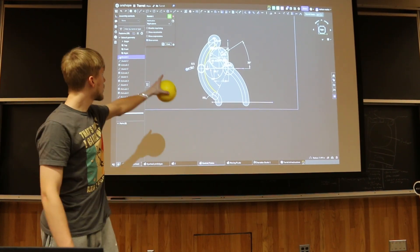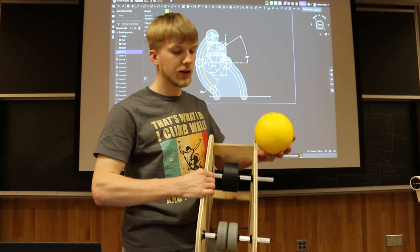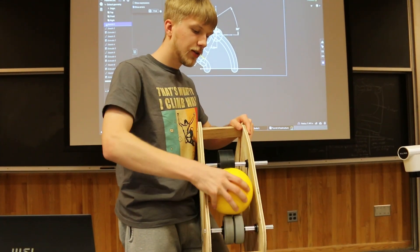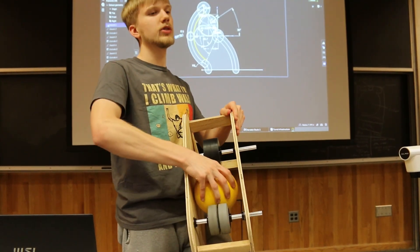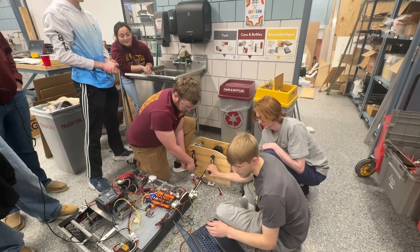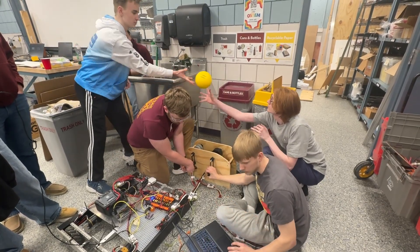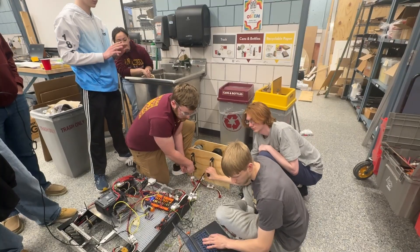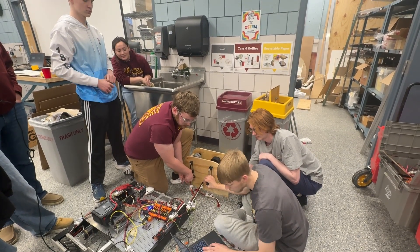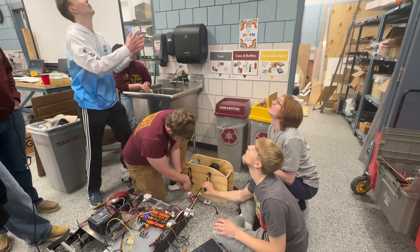The compression of those wheels is about a centimeter on each side right now, which is quite a bit of force to push through. We did some tests with this setup at 3000 RPM. We have two different size flywheels — one's about 3.5 inches and one's about 4 inches — and the idea is to get some topspin on the ball to get a good loft so that it drops in nicely.